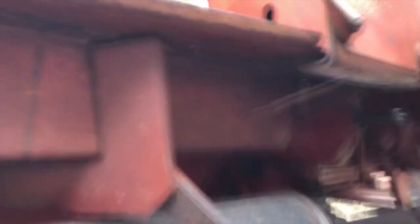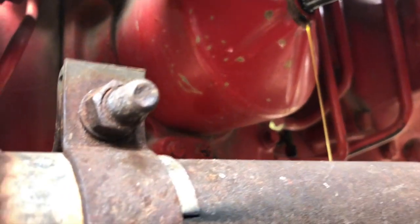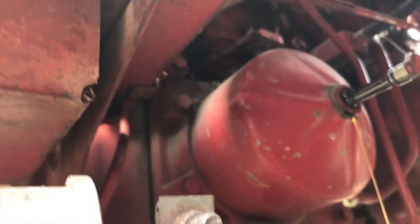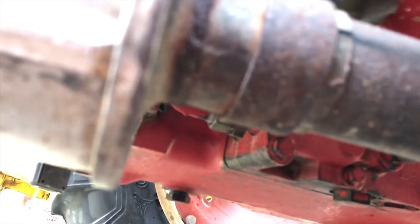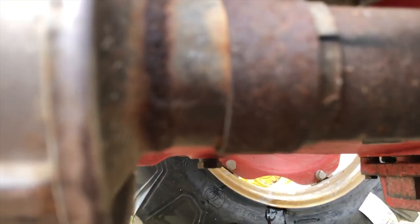Right down here on the left hand side, I'm going to have to give it a love tap. This is a housing right here that houses the filter. I'll give it a love tap and knock her loose. I hope there is a check valve in there to keep 10 gallons of hydraulic oil from flooding out all of a sudden — there should be a check valve, at least if International was smart about it. I don't think this housing has ever been off and she doesn't want to budge. I'm hitting up high, kind of towards the edge. If I hit down low or closer in, I'll bend it and won't be able to get the thing to seal up again.